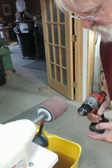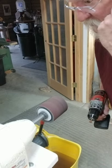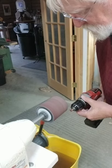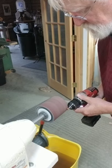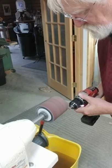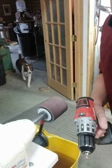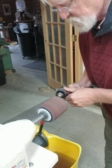I've got the drill in reverse. Anything that you can fix a sanding disc to will work for this. I'm just going to turn it down. It's probably about three-eighths of an inch now. The back side of it needs to have a taper on it, so I'm just gonna get over here.